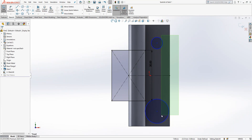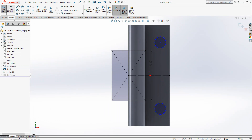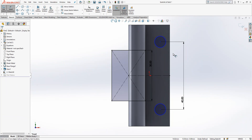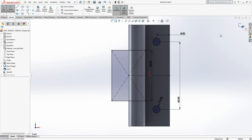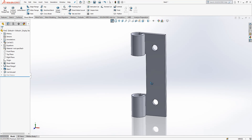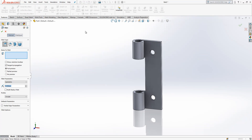I drop them here, select three objects, and make them symmetric — so now the diameters are symmetric and positions are symmetric. It is very convenient to use such features. We have 40mm here, and we have a distance of 8, so the diameter will be 4.5. It is good — sketch, extrude cut, both sides, Through All — so everything will be cut.